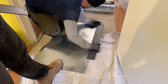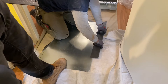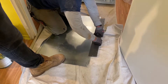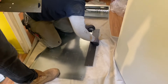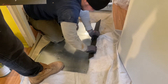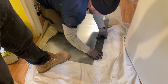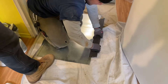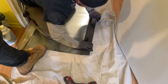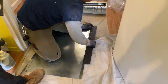I think this is his first time ever doing it — I know he's seen me do it a few times. Go up a little bit. Put some muscles into it. Go to the end — don't do it all at once. You've got to gradually go across. Watch the end of that sheet metal, it's sharp. Keep going to the end. Then go back to the other end and gradually bend the whole thing, because it's only a 24-inch. Slow and steady wins the race.